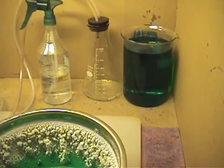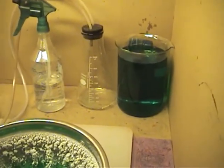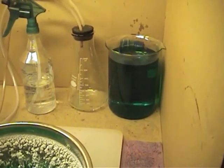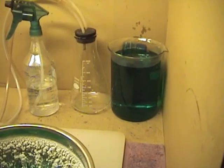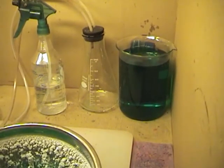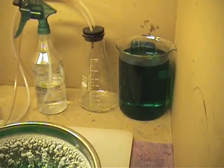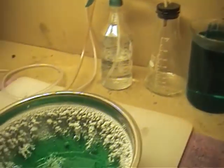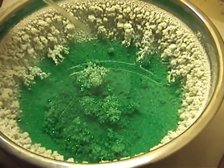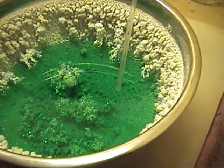Alright gentlemen, we've emptied some more of our solution from our bowl. As you can see in the back right corner we've drawn off about two thousand milliliters of solution now. Our beaker is another thousand, so by the time we finish it will all be contained in those two beakers. Then you will take it, put it back in your stainless pot, add copper like in the previous video to recover your cemented powder. Now let's get back to trying to recover our silver crystals from the bottom here — we're going to remove some more solution and see if we can see the top of the trees.